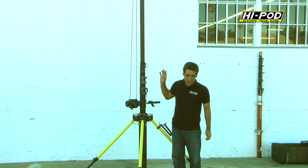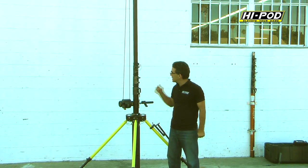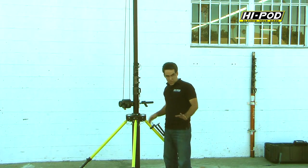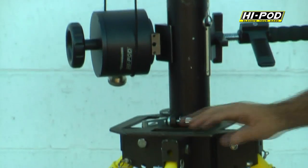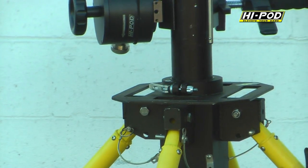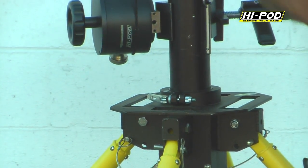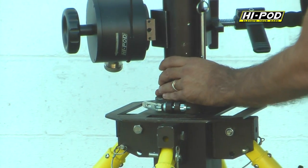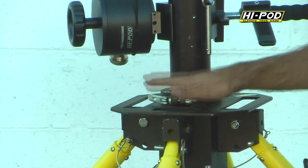All right, now we've elevated 3 stages. We're next to the 4th and 5th, and the 6th is the one that's already in the base. But let's elevate this 4th stage, and I'm going to do something here that you haven't seen yet, and that is there's a collar at the top of the base with a cam also, and if I tighten this, it acts as a drag, but in this case, it acts like a second set of hands, a second helper. And as I'm starting to use a little more force by lifting these tubes, what it's doing is holding this one to the base. So if you don't do that, it potentially can lift the tube out, the pin out of the hole at the bottom. So this is a really nice little feature.